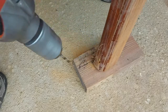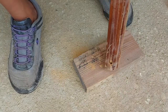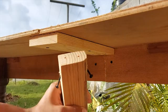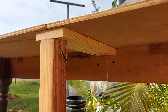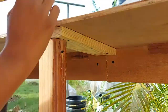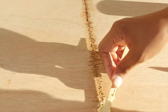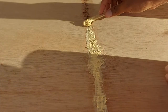After putting in the two extra legs, I realized that the center was sinking a bit and I needed to put a third leg right there, so that's what you'll see me doing here. I had this extra piece of wood that I'm just going to screw onto the center of the table. Anytime you're cutting plywood, expect that the saw is going to rip up the edges of your ply — that's just how ply is.